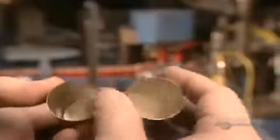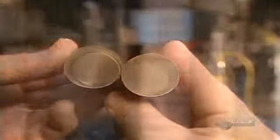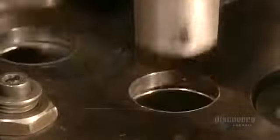Machining the cap takes but a fraction of a second. They sometimes have to assure the water tightness of a container such as a wine bottle. For this, a polypropylene liner is inserted which hermetically seals the container. A check is carried out under a light to verify whether the cut has been properly made and the ridges well formed.